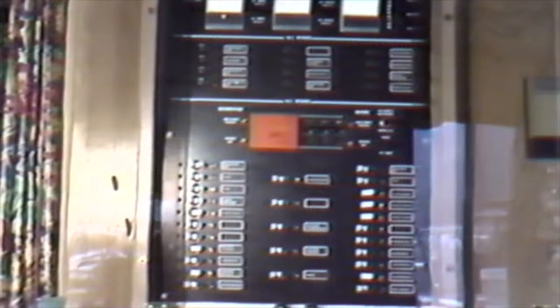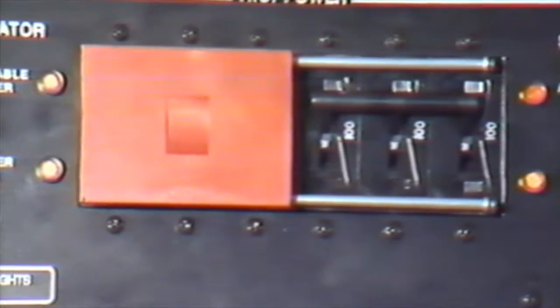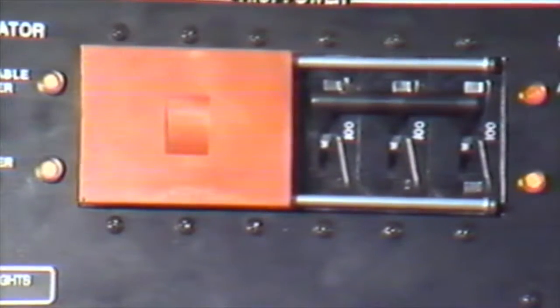You must always monitor the water level of your batteries. When the boat is in port, the shore power light will be illuminated. This indicates that we are receiving all of our power from the docking facility, as the generator is not engaged. In this operating cycle, we can shut down the shore power. Storage shore power will still be available to required sources and will remain for a short while until we engage our generator.